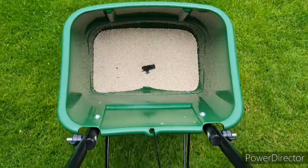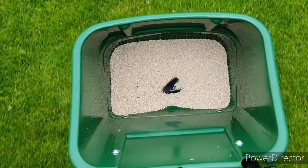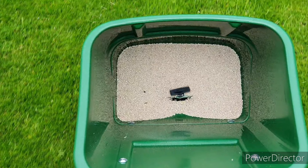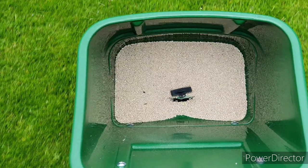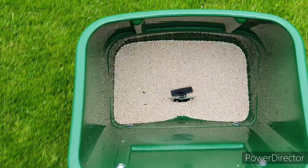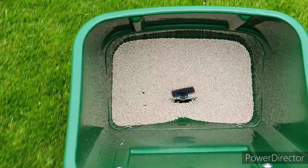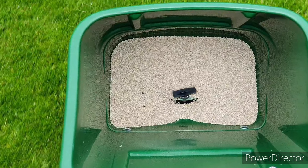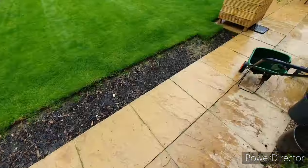Second top tip for using this product is when the granular mix gets near the bottom, the spreader doesn't properly agitate all the mix. You can get around this by using a little bit more material than you need, so you'll always get left with a little bit in the bottom to transfer back to the bag, or you can bump the spreader by jumping it a little bit to agitate the granules yourself, but I generally lean more to overfilling, as it'll give you a more even finish.